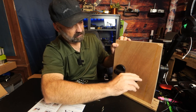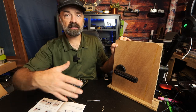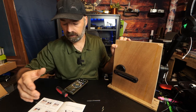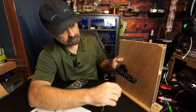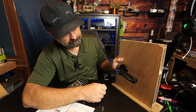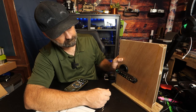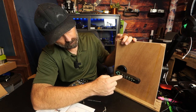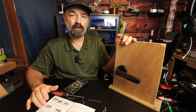Because I was the first to use my fingerprint, I'm the admin for this lock. To add a numeric password, unlock it with the admin fingerprint first. The lock prompts to add a fingerprint or password — select password, enter your code, then hit pound to confirm, and enter it again. I entered 1 through 6 — operation successful. Now the door is locked, and you hit 1-2-3-4-5-6 pound and you have access.